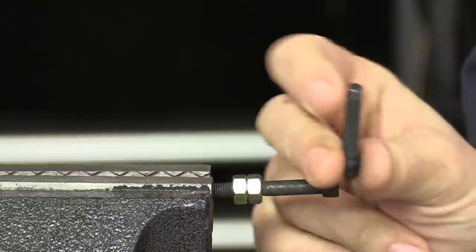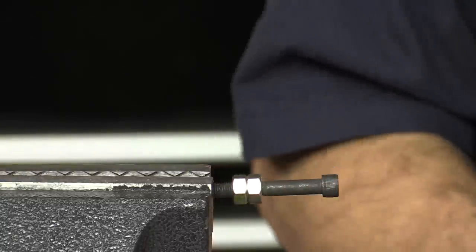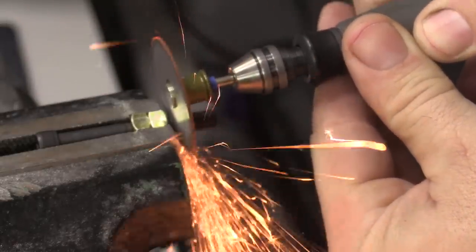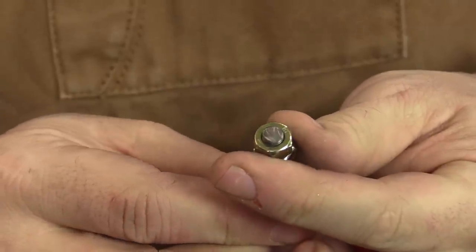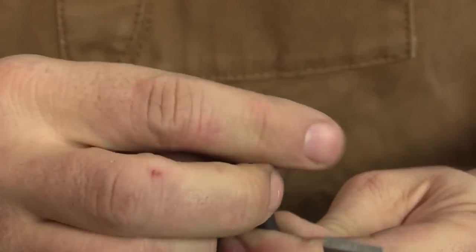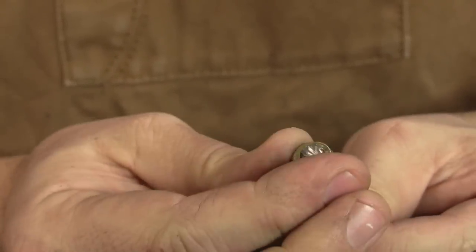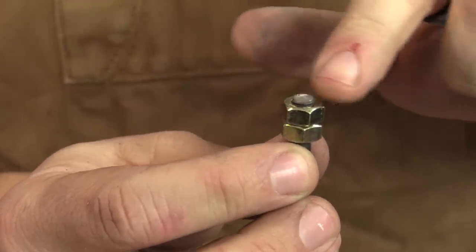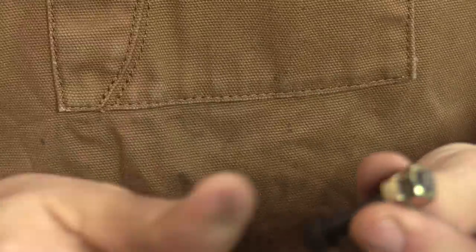What I'm going to do is make a duplicate of this screw. I've marked where I need it to be, and I'm going to make it a little bit tall. I'm going to go ahead and cut this — I'm just going to use a cutting wheel in the interest of time. Make sure you're wearing eye protection whenever you're using any type of power tools, whether there's metal shavings or even filing — your eyes don't grow back. You can see the surface of the cut is not exactly good; it's kind of rough and has a slight angle. But I can still loosen the nut over the threads — it kind of cleans those threads up a little bit — and I can definitely put the nut back on. So it is a usable fastener. However, in my opinion, it's really ugly and I don't like that.